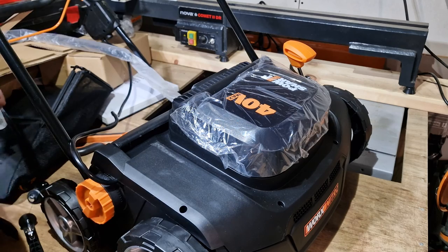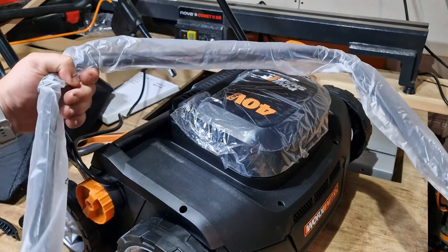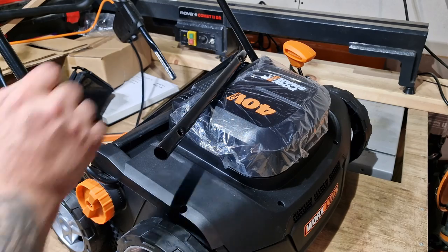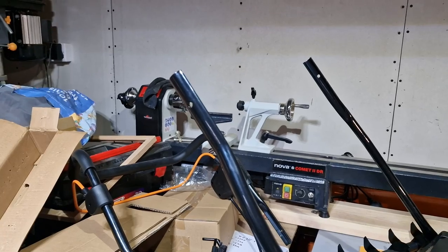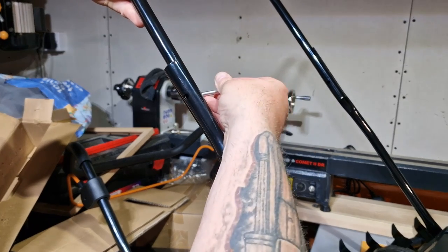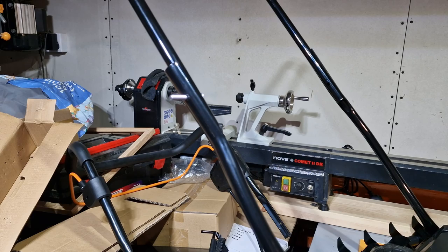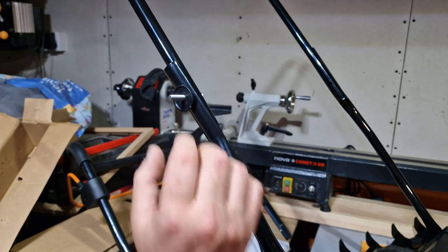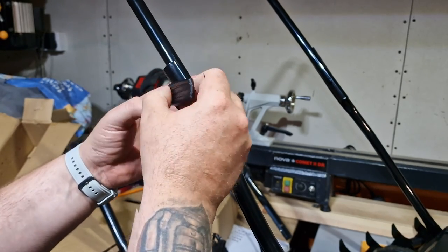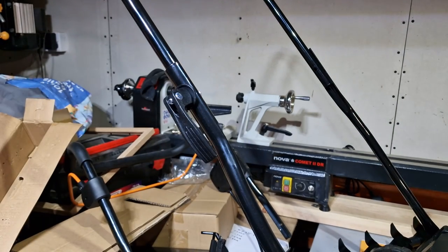Okay, then I suppose the next bit is this looped mid-handle. You can't really see it in the frame because it's too big, but there it is. And then we're going to have to figure out how on earth these work. Right, we're going to try and install the mid-handle now. It just goes in here. This bolt, which is an M8 coach bolt. Actually, I think it's an M6 coach bolt, but it goes through there. Then this washer goes profile side against there. And then this just simply rotates and screws on the end. So we'll just put one in the other side.